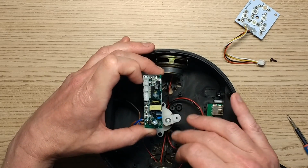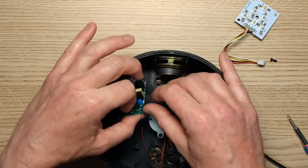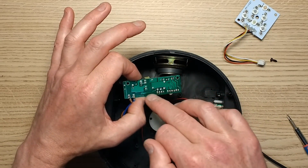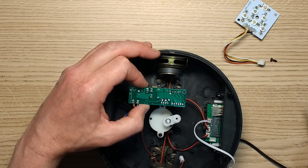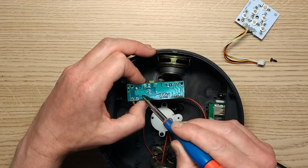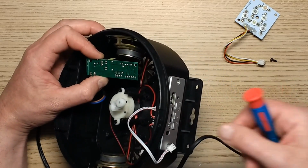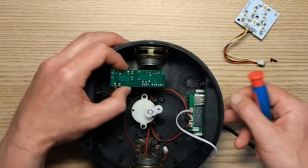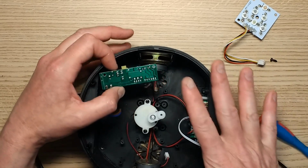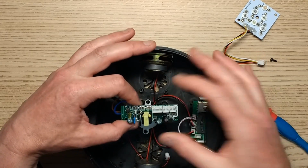I would expect that maybe, given the placement of the circuitry, they've got some of the low voltage circuitry coming back along here. They start off doing quite well with the separation here, and then it kind of is defeated by the fact it's quite close there. But having said that, unless you were plugging a metal USB stick reference to the circuit ground, there's nothing really in here that would pose an electrical risk of contact.